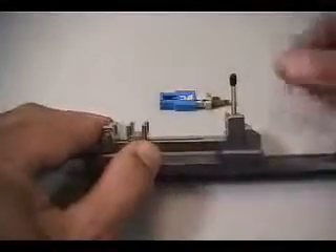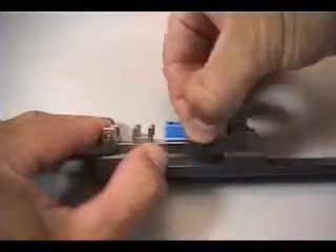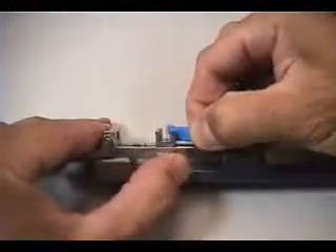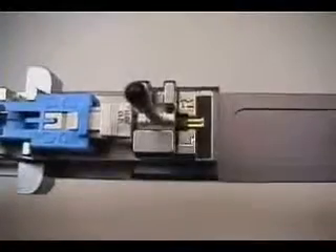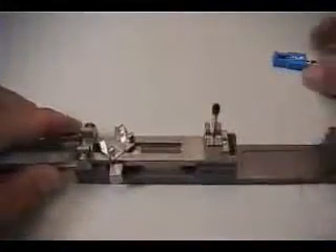Pull the slider back out of the way and insert the connector into the tool as far as it will go. You will need to angle the connector slightly up through the opening for a proper fit. The lead-in tube should rest on the crimp platform when the connector is fully seated. Do not attempt to force the connector into the tool. Alternatively, the slider may be held into place by partially rotating it, freeing both hands for inserting the connector. Finish by rotating the slider back to the wide position and gently release onto the VFL adapter.